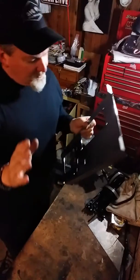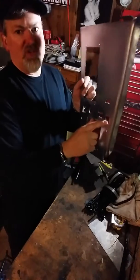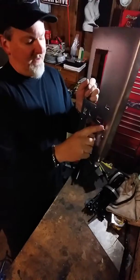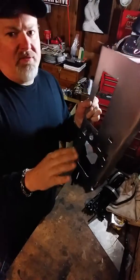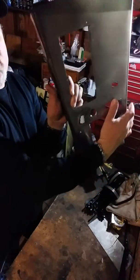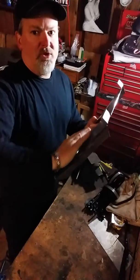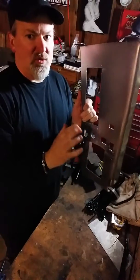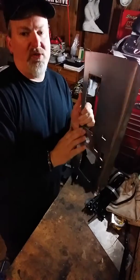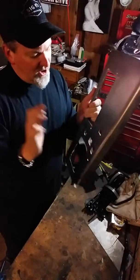What I'm going to do is trial fit this. I'm pretty sure this hole here is too small — I might have to open this one up. This one I might have to close up. I'm going to use body filler on it. You can see it's kind of dull because I sanded it with 100 grit sandpaper to rough it up a little bit, so that if I need to put plastic filler in here, it'll bond to the metal. You need to rough up that metal because if you leave it smooth, the plastic body filler will not grab as well.